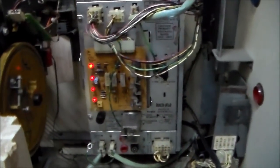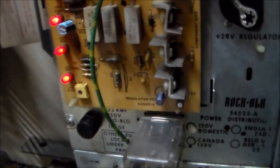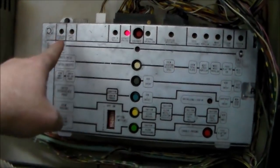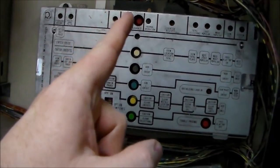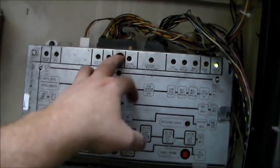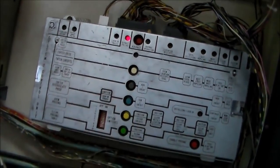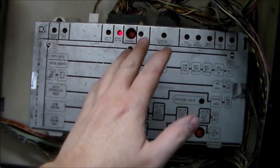I plugged it in and we're getting all four of our LEDs on the power supply board turning on. It says Motor, Negative 28, Positive 25, and Positive 12 — so all of those voltages appear to be working. Up here on the CPU it came up and this light was lit over where it says Standard Pricing, then it went to Default Pricing which I think is fine, but I think you need to get it over to normal operation. I don't know if I need to go in and program it — let me look in the manual about how to program in the pricing.